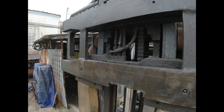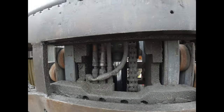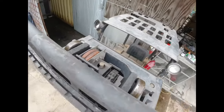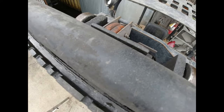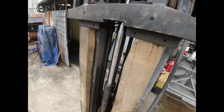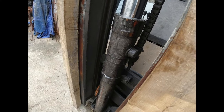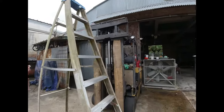This little bunch of hoses right here are not connected to the cylinder I want to get out. I need to get those two bolts there and two on the other side, and one up at the top. I think if I support that conglomeration of chain and hose, I can break one of the hoses and let pressure off the cylinder, and the cylinder should collapse all the way down. Then by taking off these two big bolts, the bottom of the chain should be able to get out of there.